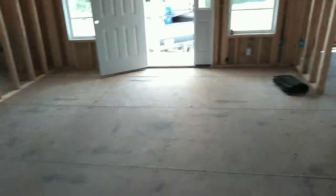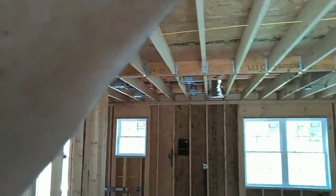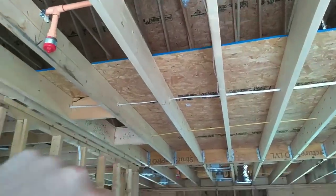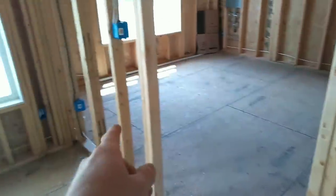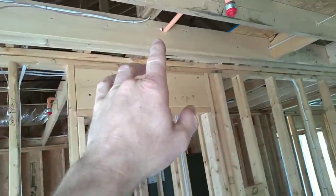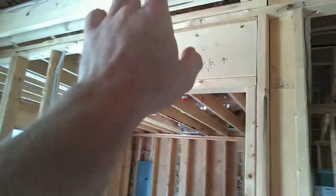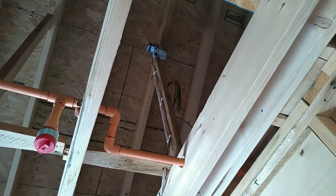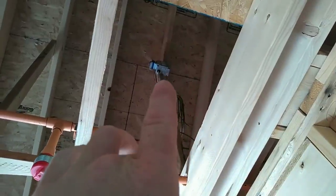We're good on that. The heating and air is going to be located somewhere up in this attic, and I have to serve it with a receptacle. What I've got is a line tagged from the master bedroom that travels up here and goes across to feed that location — a 1900 box with an outlet face on it.